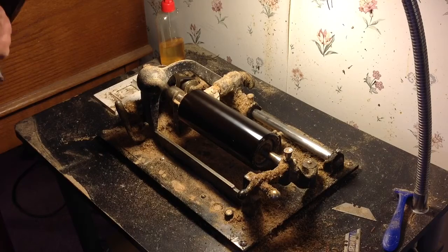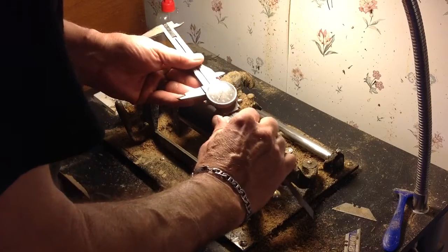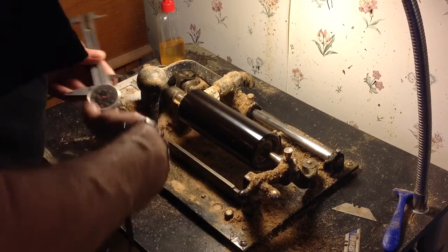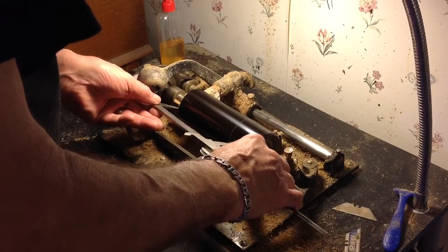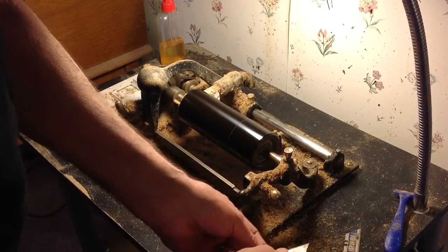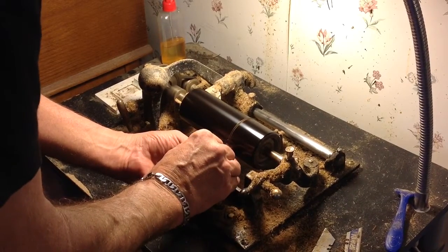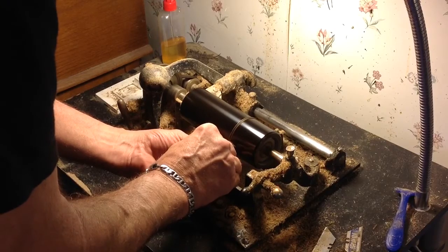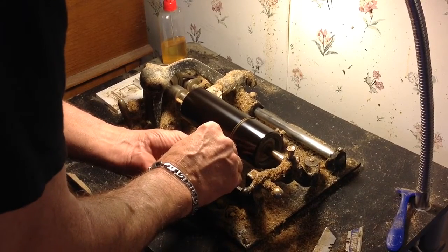To do that, of course, we use a vernier caliper. This is a really simple process if you have a shaver. I use a vernier caliper and I set it to 4.3 inches — 4.3 inches is right there — and then from the end of the mandrel I make a score line into the wax. That's our cutoff point, so now using a box cutter blade we cut the cylinder off.